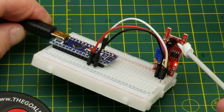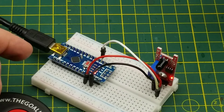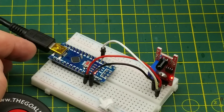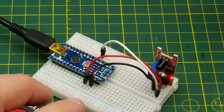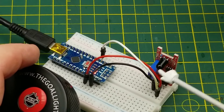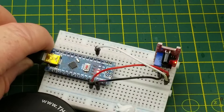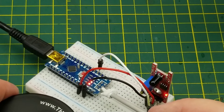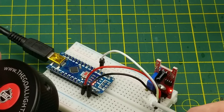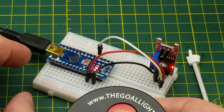To test this I've grabbed a basic infrared receive module - it comes with a lot of Arduino starter kits. I grabbed a random Nano and loaded it up with some example code from the infrared library. What it's supposed to do is when I push the button and it generates its IR, this thing should translate it into signals coming into D2 on the Arduino and flash the built-in LED in sync with that to indicate it's receiving.